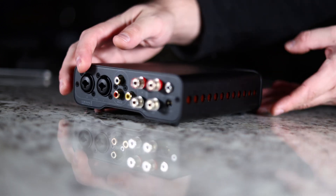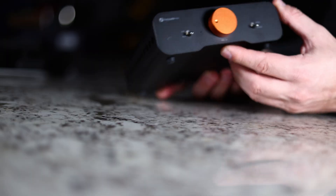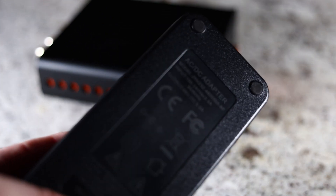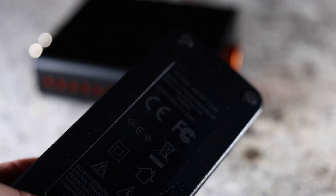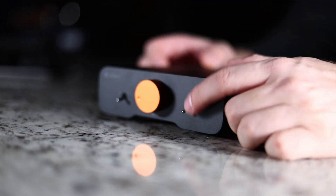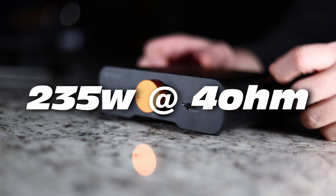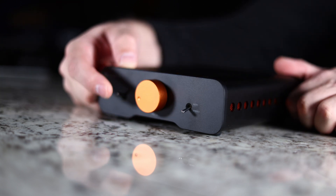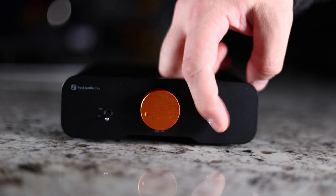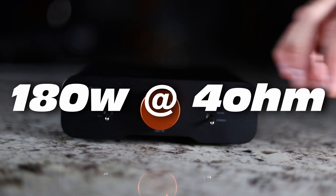I love the fact that they give you the ability to add either TRS or XLR. On the right-hand side on the front, it does have a switch that goes to mono and stereo. And that's pretty amazing because this thing comes with a 48-volt, 5-amp power supply. The chip in it is the Texas Instruments TPA3255, which gives you a lot of power. At 4 ohms, this thing is capable of 240 watts output RMS in mono — that's at 1% distortion. If we swap this down to stereo, it goes to 185 watts.